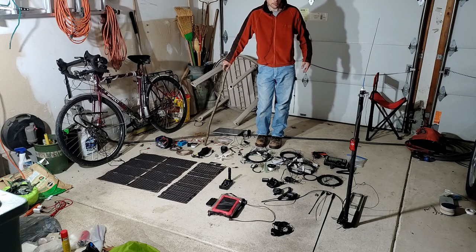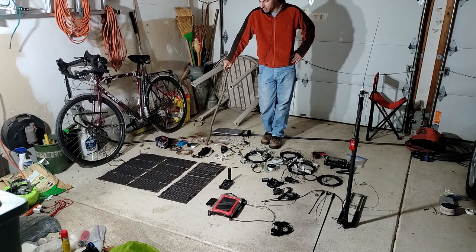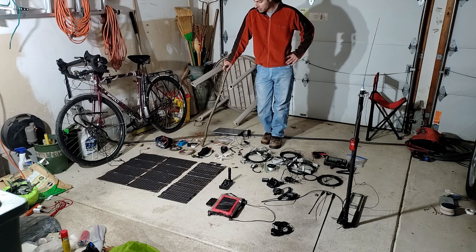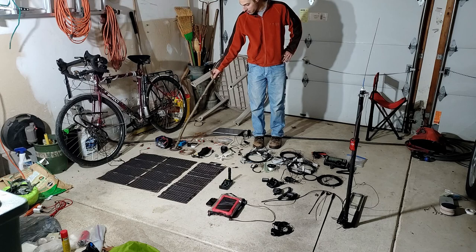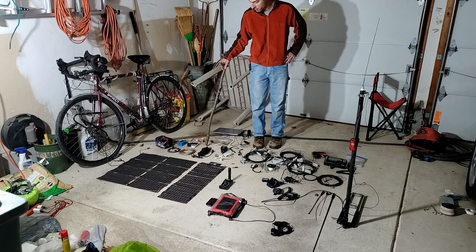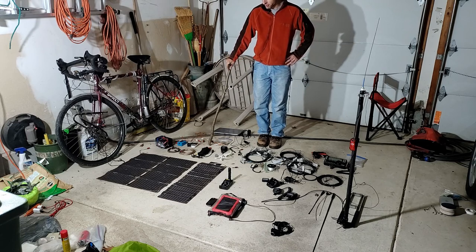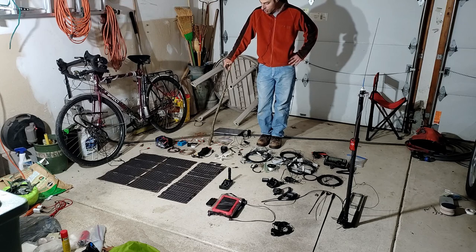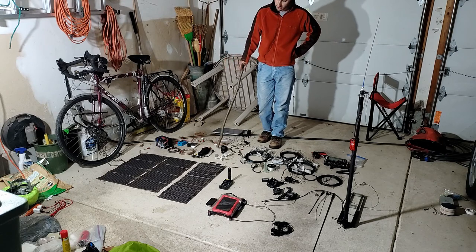So in one of my pictures that I'll show, I've got the panels on the outside of the tent and then the battery and everything on the inside. So I just ran that extension cable from the panels outside to inside. This brown cable has three power poles on it. It's got two on one side, one on the other. So I'll use that to link the two panels together in different configurations. That makes it pretty handy. Of course, with the way the weather was this particular trip, I did a lot of charging being plugged into an outlet.